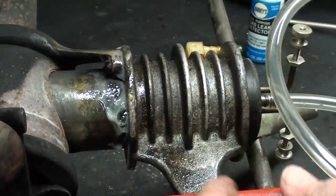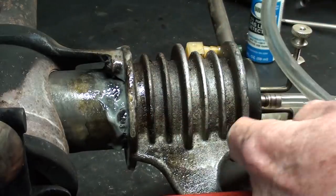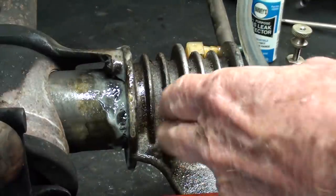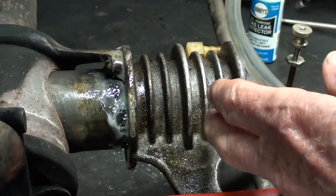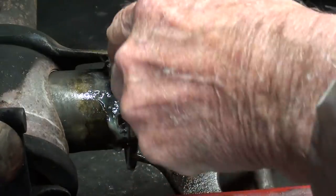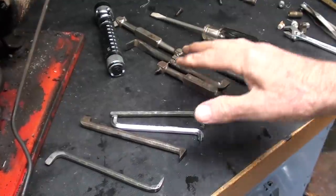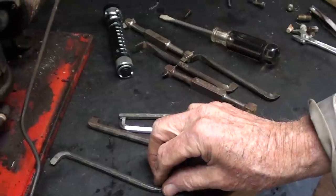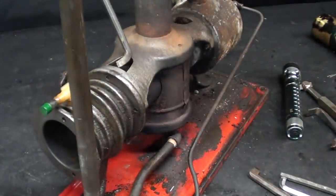What I'm going to do now is remove three or four screws here — I believe this end of the cylinder will come off so we can take a look inside, check for damage and examine the bore a little better. There might be a gasket in here. For the sake of convenience here in the basement, I've removed the cooling tank and fuel tank. I knew that if I lived long enough I would finally have a use for these offset screwdrivers, because this is a tight place to get into.